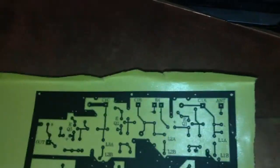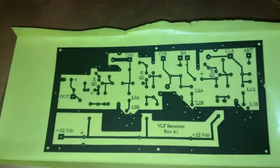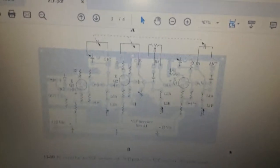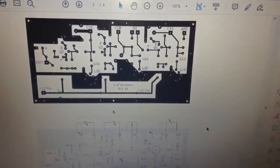Here is my PCB — it is not too long, not shaped very well, but it will work for me. Here is the good size that I will use to re-transfer the PCB layout by iron onto the PCB. But before starting this process, I need to sandpaper, wash, and clean the PCB very nicely.